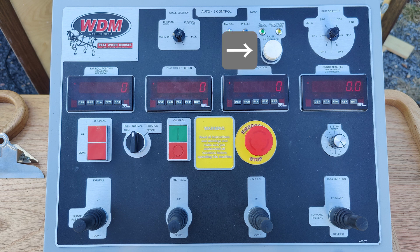The white button beside the mode selector is the pause or set point override button. If you're running in auto mode and want to stop the cycle without hitting emergency stop, you can press this button to pause the cycle without shutting the machine off. If you're in preset mode and you've hit your set point but want to roll just a little bit tighter, you can hold that button to override the set point and continue raising the roll past your programmed setting. The part selector has six positions — parts one through six — with a list A side and a list B side with corresponding set points.